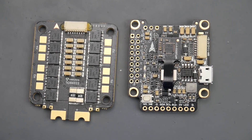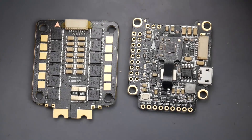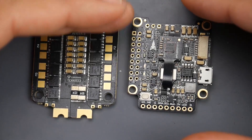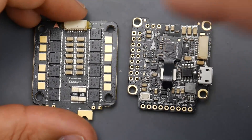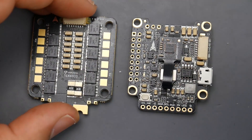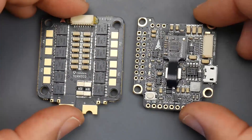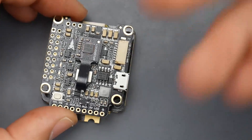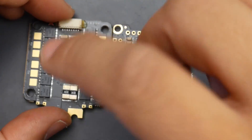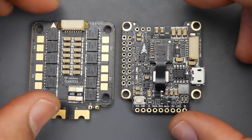This is a premium stack - kind of a budget full-spec stack. It's a step up from super budget setups running BLHeli-S because this runs BLHeli32 with F3 microcontroller units, which perform a lot better than the BB2 chips and F1 chips on other BLHeli32 ESCs. This is a proper setup. I'll be doing a 6S build video with this, and I'll also be releasing the ESC noise testing results in the upcoming days. Everything will be linked below - see you in the next one.